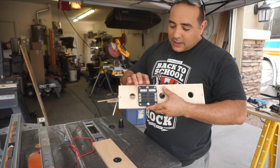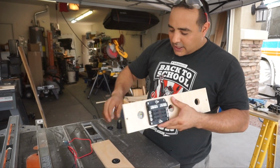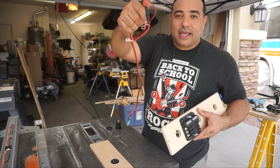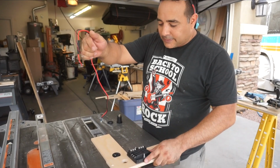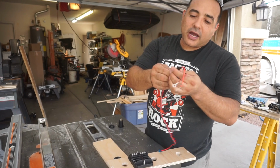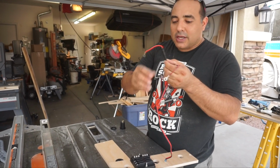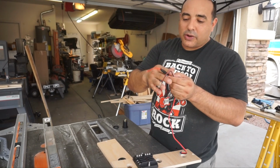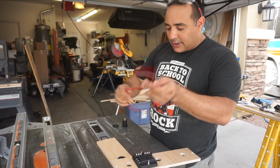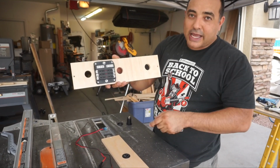They're all being set up with this fuse block. Each one of these will carry, here's the wire that it came with, and each one will go into a different fuse, and then we'll probably cut off the fuse that it came with. It came with a little glass fuse. We probably don't need to fuse them twice, so we'll cut that off and just fuse them here. These have indicator LEDs to tell us if one of them goes out.